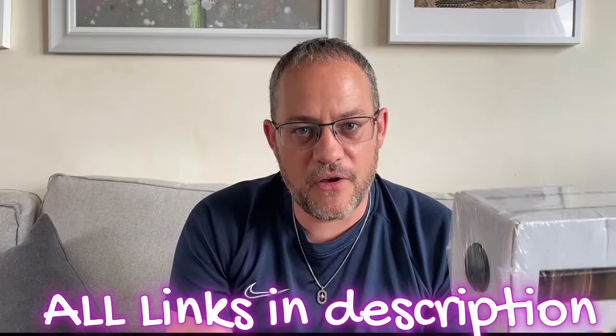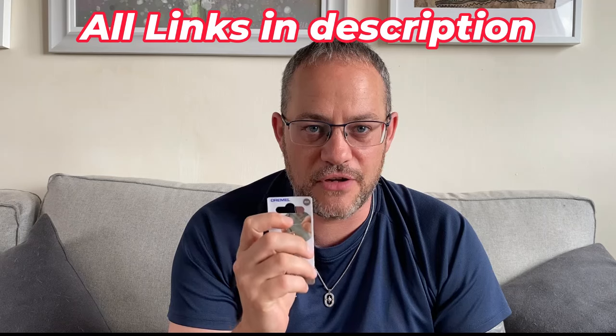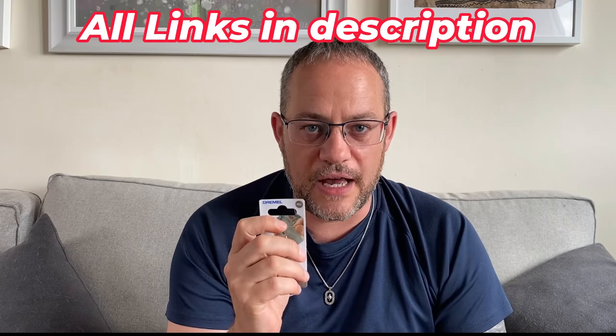This is emery backed cloth sandpaper. It has to be the emery backed cloth — otherwise this won't work very well if you use standard sandpaper. I got this in a range of 80 grit all the way up to 600 grit. I've also bought some Dremel mandrels which are the 402 versions. I'm going to show you guys how to hopefully fix your sanding problems and start sanding like a pro.